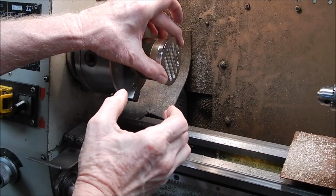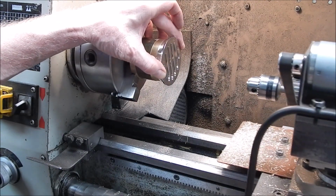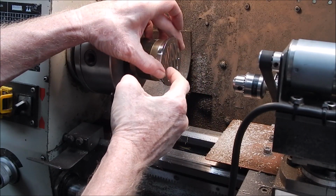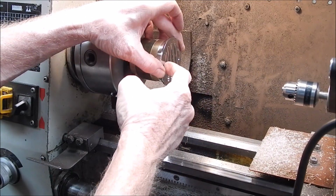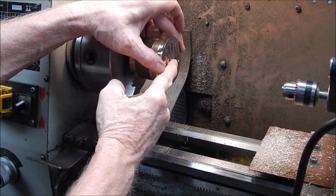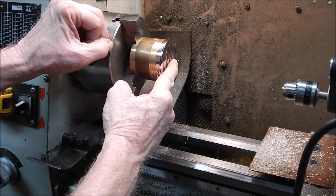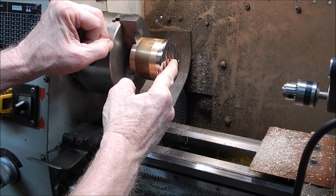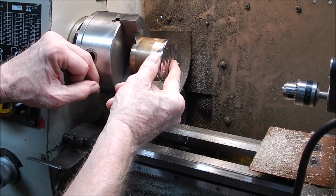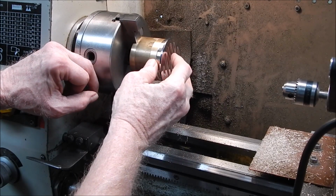like so, and then we'll drill in with the drill here in two places in the slots, and then we'll put locating screws or bolts in there, and that way then they'll pull in flush, and I can spin the thing up and machine off the edges. Should work perfectly. So I've done that, so I'll bolt it on and you can see me turn it down. It's a simple way of doing it, but you've got to think about these things, and yeah, we'll get on with it.